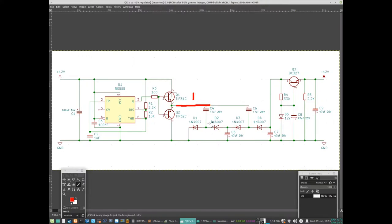With 12 on the positive and 1 on the negative side of the capacitor, when the square wave goes from high to low this discharges. This side wants to go from 12 to 0, and the other side also drops by 12, so if we have 1 minus 12 we end up with negative 11 — that's how we get our first negative voltage. Current flows through the diode on the next capacitor and because we have a drop of around one volt we end up with negative 10 over here. The plus side of this capacitor actually goes to ground because we're generating a negative voltage.